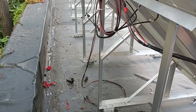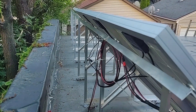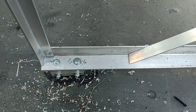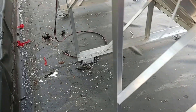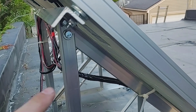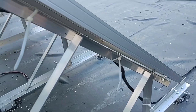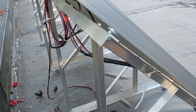Now I've finished installing the rest of the spacers as well as bolting the mount in place. I added a couple bolts on top of the spacer and then bolted it to the base plate of the mount. I'm going to do that for each of the supports. I've got my panels installed as well, just using a couple of carriage bolts right in each of the corners. After that, just wire it up to your charge controller and you're all set.